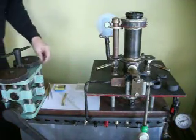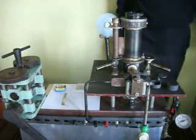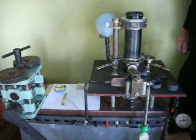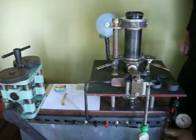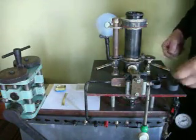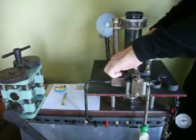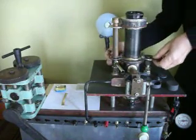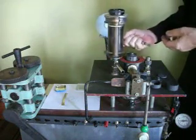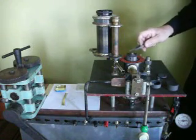Now I'll bet you that the furnace is cool enough to open up and remove the second casting. Our system has numerous advantages to the induction heating method too. These include substantial energy savings, using 1/5 the energy with a Q30, not the 95% energy loss of induction heating. Also, our system doesn't require that the load match the coil. We can cast varying loads.